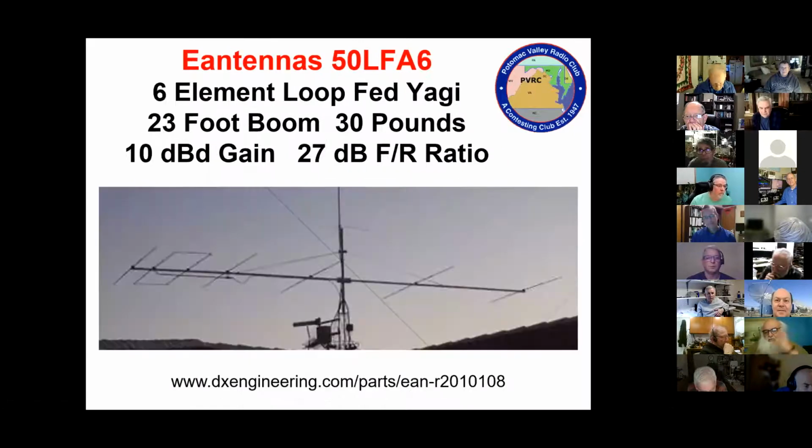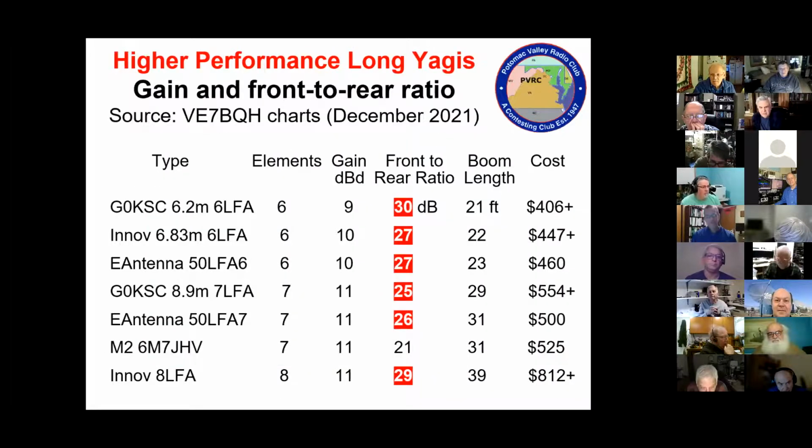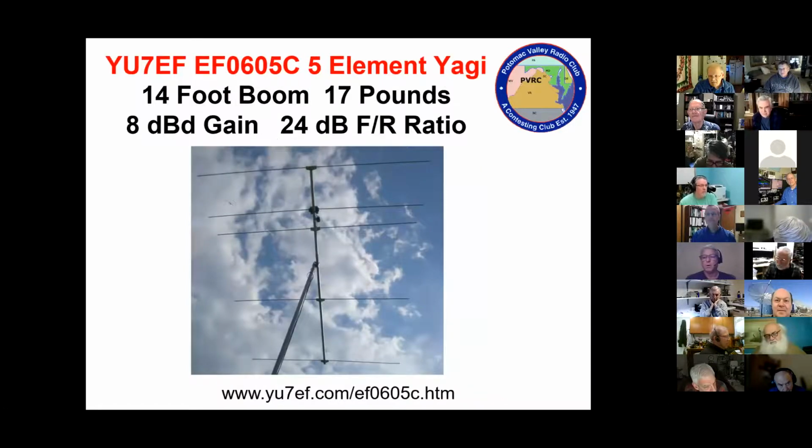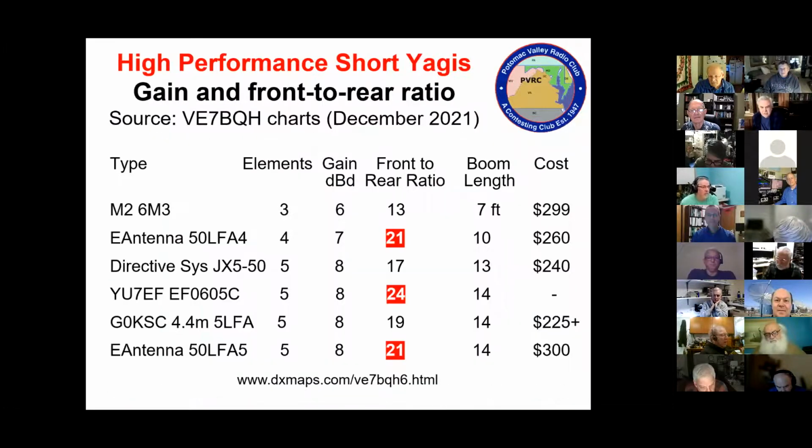Well, in terms of the tuning of the antenna, as long as it's, let's say, about a half wavelength away from all the metal in your house, it's going to be fine. So in terms of detuning, that's really not an issue if you can get it at least, let's say, 10 feet away from all of the metal in your house. And there's lots of metal in a modern house. Another suggestion is to aim it vertically up, put the reflector on the ground, just aim it up. Yeah, you could do that to adjust the SWR.